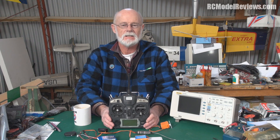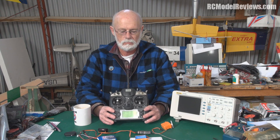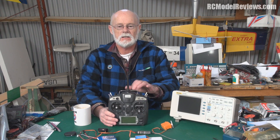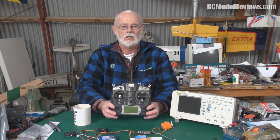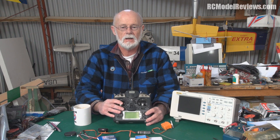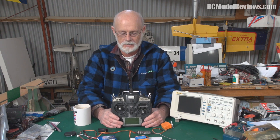Latency is the sum of many things. We talk about the latency of your transmitter, your radio system — but actually it's not the biggest factor. All this electronic stuff happens really quickly, and typically the latency of a radio system might be around 25 milliseconds — 25 thousandths of a second between when you move a stick and the signal reaches the servo. Now, that's a pretty short period of time — much less than the time it takes to blink.